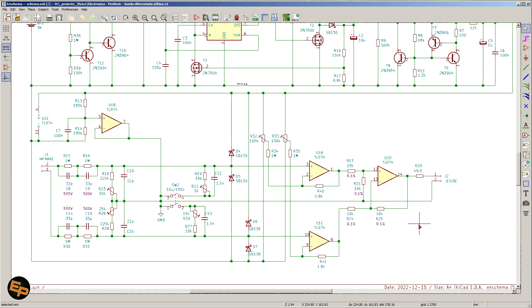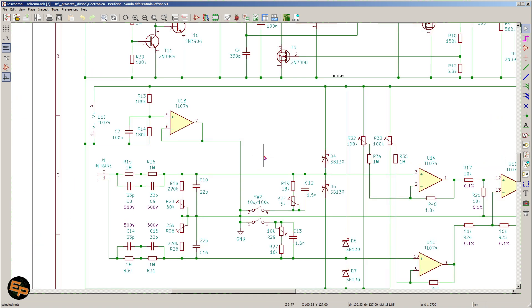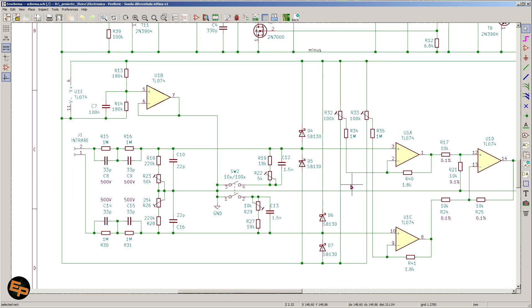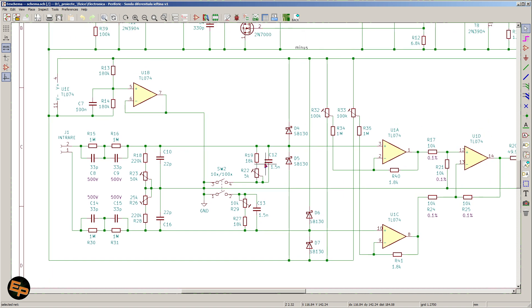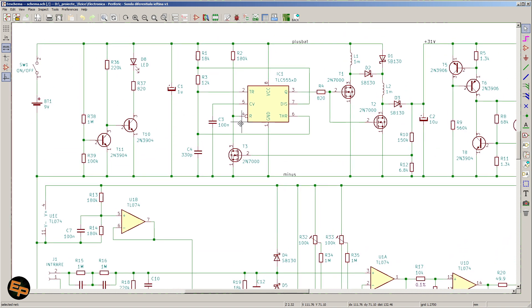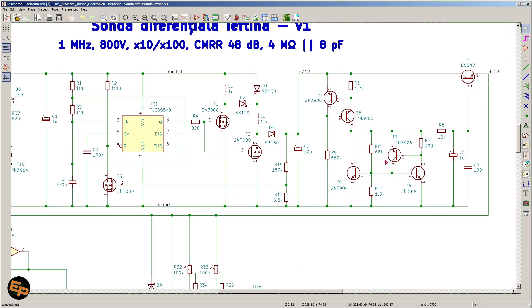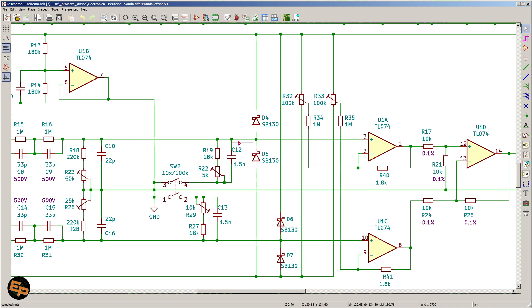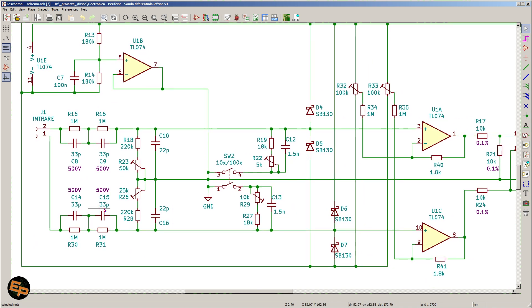When we connect a 10 milliamp load — which is going to be approximately the current this entire circuit draws — the ripple becomes about two divisions at 10 millivolts per division, so about 5 millivolts RMS. This is at the output of the linear supply circuit that goes after the switch mode power supply to smooth things out. If we take a look at the 31 volt point — basically the output of the switch mode power supply — then we see a slightly bigger ripple, about three times bigger: at 20 millivolts per division the ripple is about three divisions, with about 14 millivolts RMS ripple. So it's clear that by adding this extra pseudo-Zener stabilization circuit we are getting a meaningful improvement.